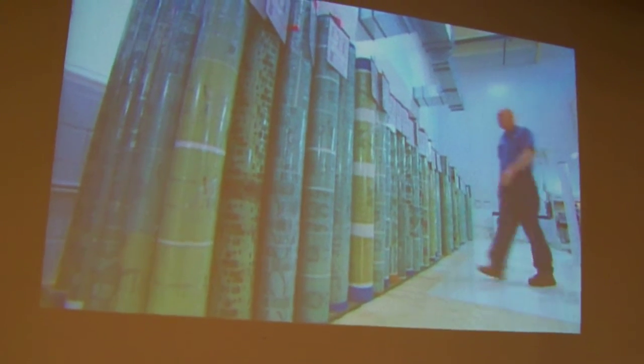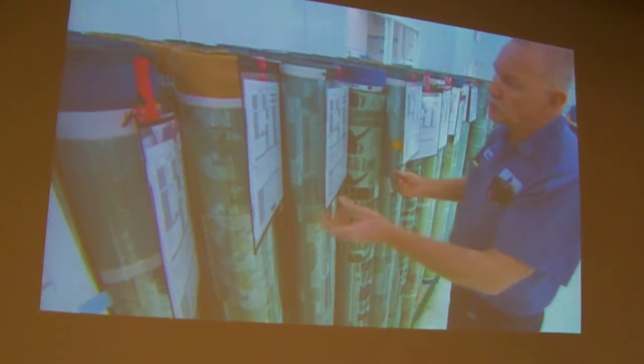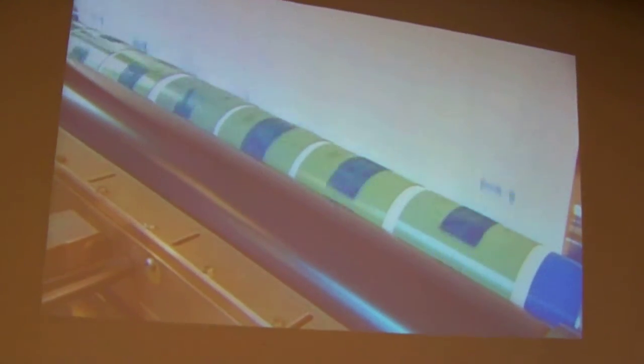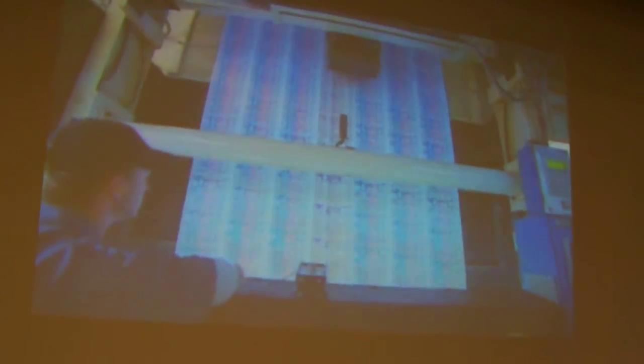The first step to making them is printing. A worker selects the appropriate printing plates for a given customer and applies them to the cylinder of a printing press. The press transfers one color at a time to the paperboard layer using solvent-free ink. The Tetra Pak container can have up to 6 colors. At full speed, it takes only minutes to print. A strobe light visually stops the motion, helping the pressman check the quality of the printing.